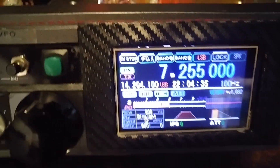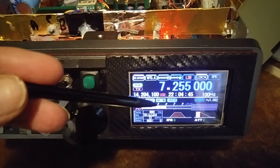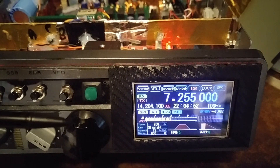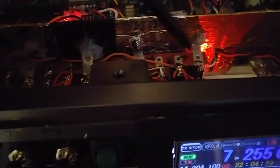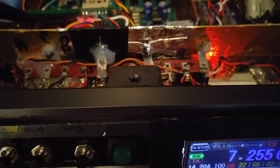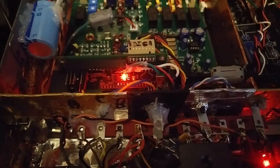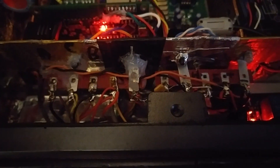What I'm going to show you is how easy it is to hook up the unit. This is the uBIT-X, and that's your Arduino. The actual display only requires four wires: a plus five volts, ground, and two wires for the serial. I have five volts running here and I'm using a separate five volt power supply so that the Arduino 7805 keeps really cool. I'm using one of those little Chinese adjustable regulators set to five volts. It requires five volts, and depending on the size of the display, the current is going to be higher or lower.